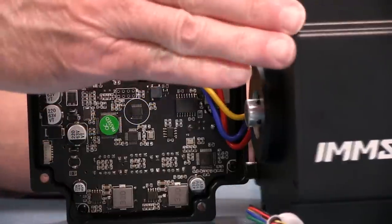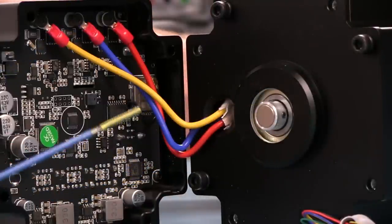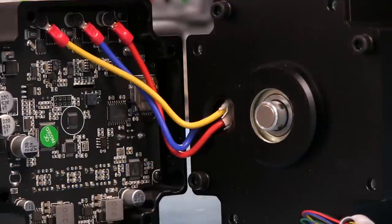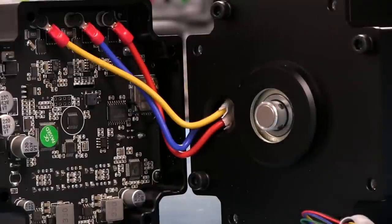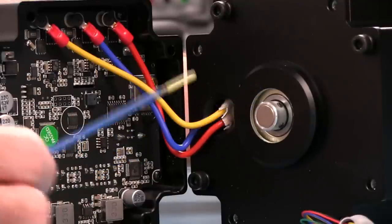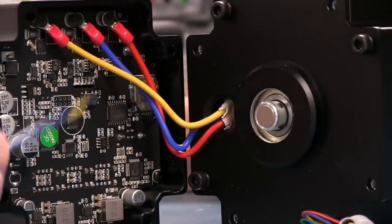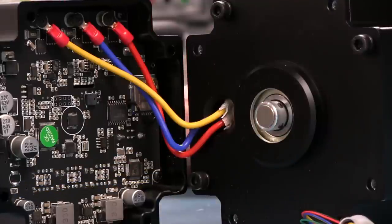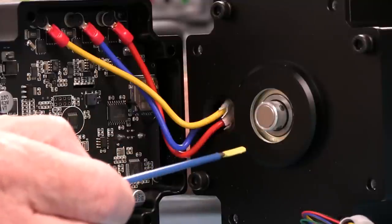Now over here on the motor shaft, we'll turn this over this way a little bit. This has a cap on it with some set screws holding on. You can see those two set screws there. And a very powerful magnet right there. I can take my wrench and you can hold it up. So that's got a pretty good power to it. Now, as this turns, of course, the orientation of the magnetic fields in this magnet will change. Our little sensor over here can sense that, and that's how everything works. So this sensor will tell these power wires what to do as far as moving the motor back and forth for our force feedback. Pretty clean, a very simple type, and there's no encoder involved here.